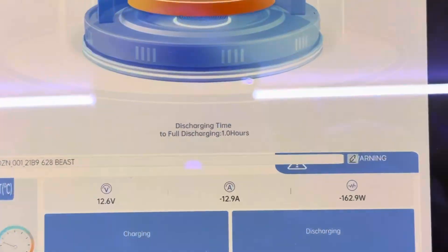I'd actually turned down the consumption on the tester a little bit last night — I accidentally bumped one of the knobs. When you get this really close to the borderline of maximum draw, one tiny touch of the knob overloads it and shuts it down. Knowing I couldn't get back early enough this morning, I went ahead and turned it down to about 150 watts instead of 175 watts. The max is 185, and even then I'd bumped it twice somehow, so I've left it at 150 watts draw.